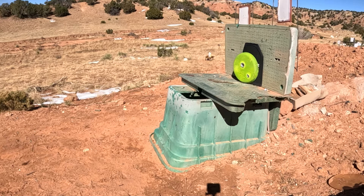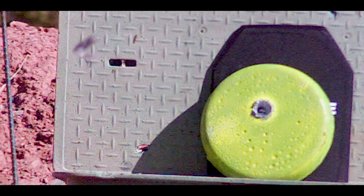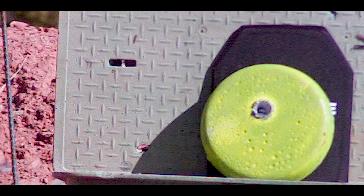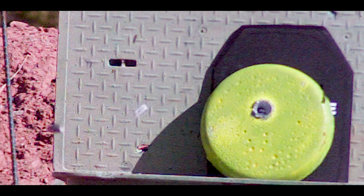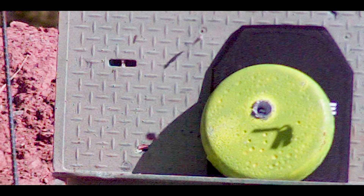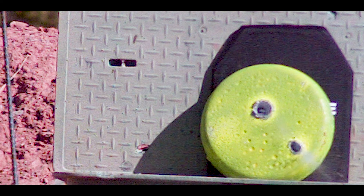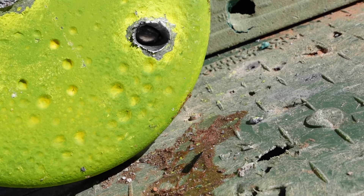Back to the lead plate with the one-ounce tungsten. Slowing down this video and zooming in finally reveals what's happening with the one-ounce fishing weights. As the sabot crosses the screen, we notice a hole in it — the tungsten projectile is being pushed out of the back of the sabot. This explains why the sabot hits the target before the projectile. To fix this, we need more support behind the tungsten projectile; in this configuration it just tumbles to the target.